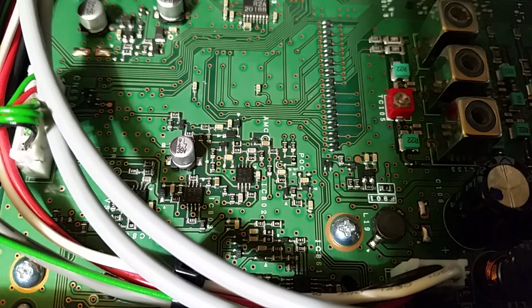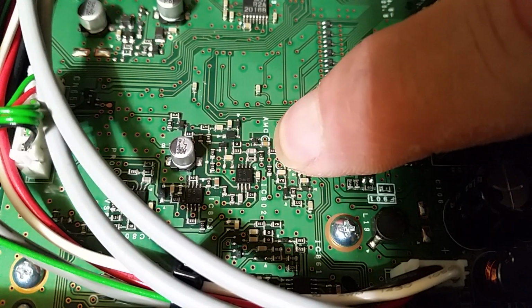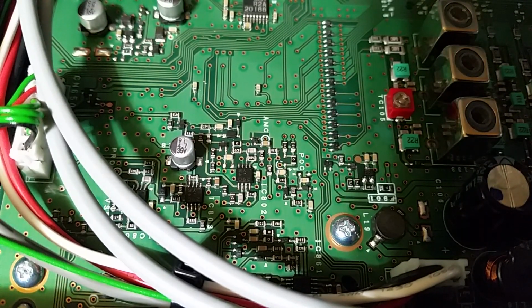So, as I said, just temporarily, I'm going to jump that resistor with a switch, and that'll shut down the ALC completely. So let me solder up a couple wires. See if I can solder to that little resistor. He's put my finger in there. That resistor even looks smaller yet. And see if we can do a quick test with ALC switchable.